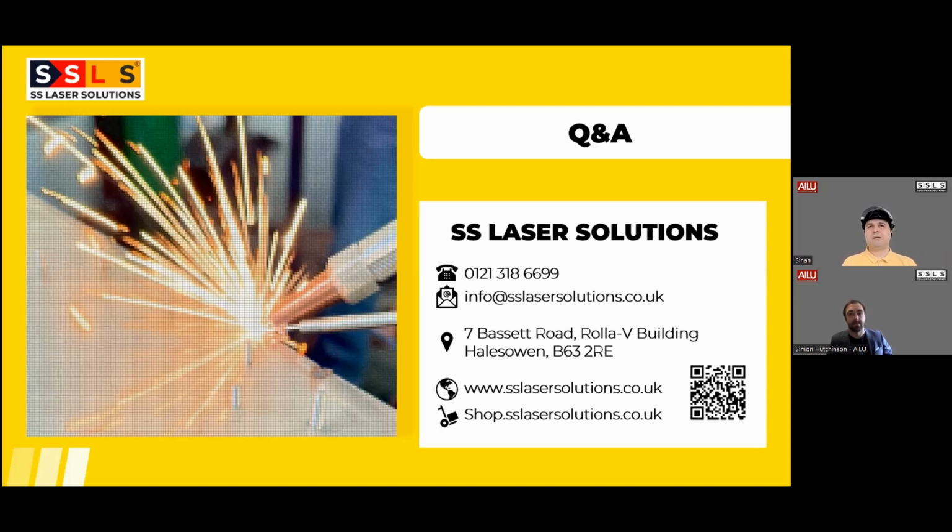But whatever you do, there will be some contamination, either from external sources or from sparks. Or when you don't use the machine, if you are leaving the torch on the welding table and grinding very close to the laser welding operation, then that's going to reduce the lifetime of the optics. It's not different compared to laser cutting. It is the same, but it is a mobile machine. It's a very flexible machine, so it is more open to contamination compared to laser cutting.